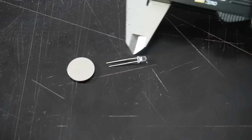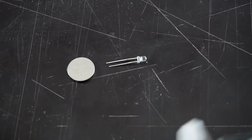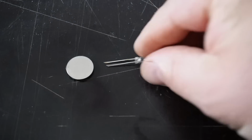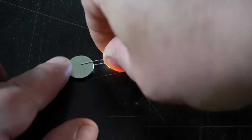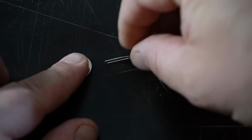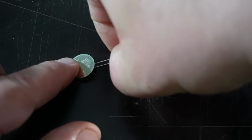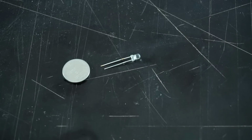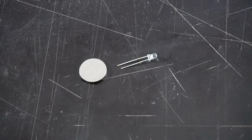The classic LEDs have 2 connecting wires of different length. Usually the longer wire is attached to the positive pole of the battery, the shorter to the negative pole. If you connect the LED the wrong way, nothing will happen as long as the power source is a 3V button cell. The disadvantage of connecting the LED directly with the battery without a series resistor is that the current through the LED is not constant. That means the older the battery, the darker the LED.